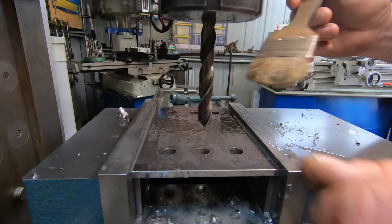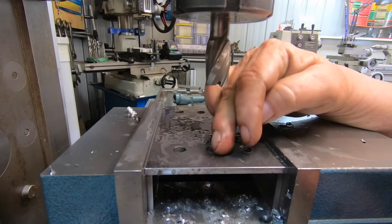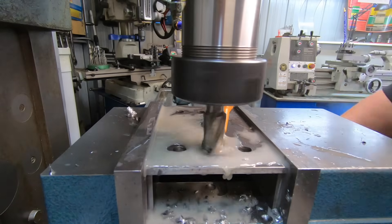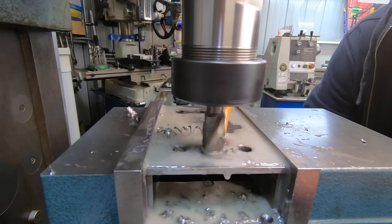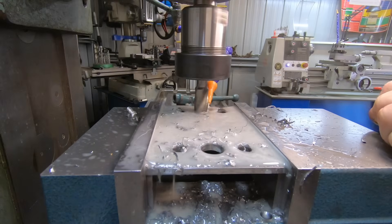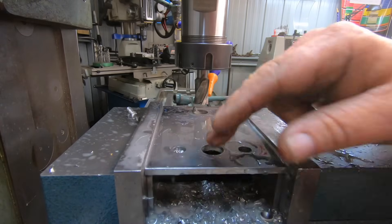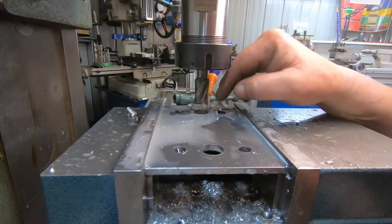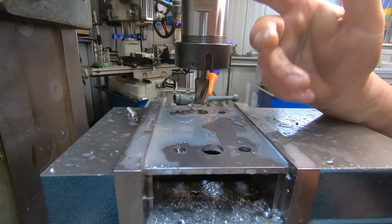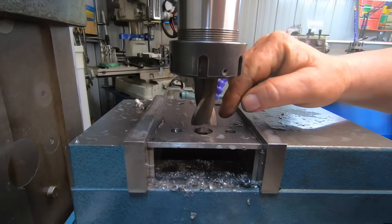You wouldn't do nothing without a DRO once you're used to it. I'm going to attempt to plunge a three-quarter hole through both of them. I don't know how it's going to go because I don't know what this cutter's like. The only thing I'm thinking is the bottom hole is larger than the top — is that to help with the flow because hot water rises? I may open the bottom one up a fraction. I've got a 24mm cutter that I'll open this one up with.